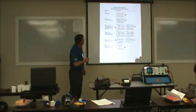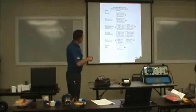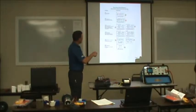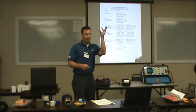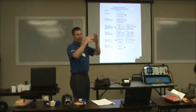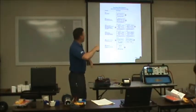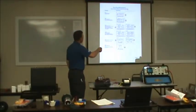This particular motor, this 9-lead motor, we call it a Y-connected motor. Low voltage, it's two Ys. You see that Y right there, we call that a Y. Those three wires are tied together because when your leads come up and come together inside the motor, it actually makes a Y. It looks like a star, so you might hear it called star connected. I don't know if y'all ever heard it called star connected. Anyways,